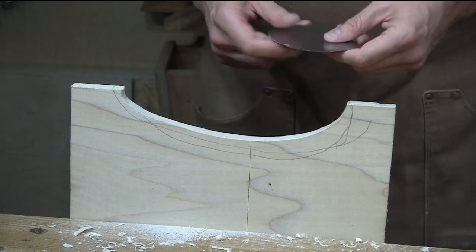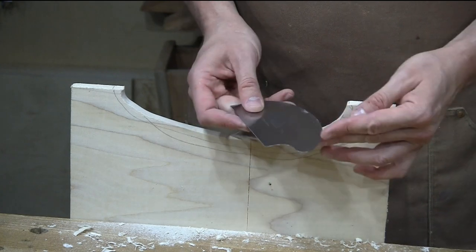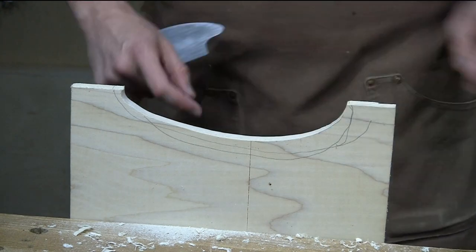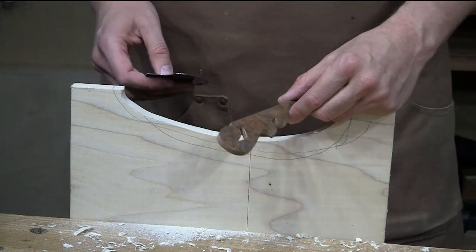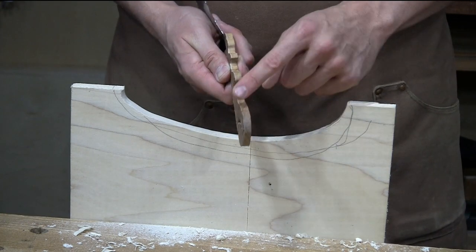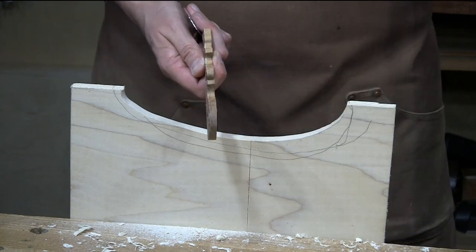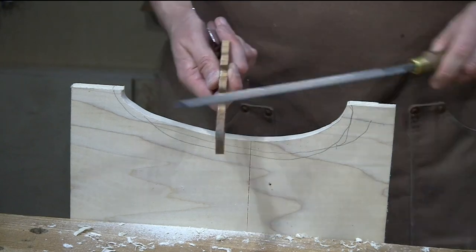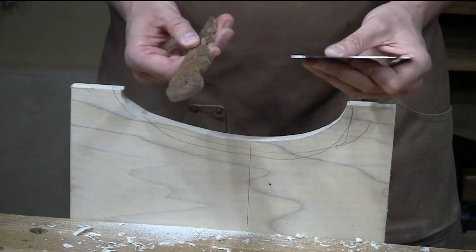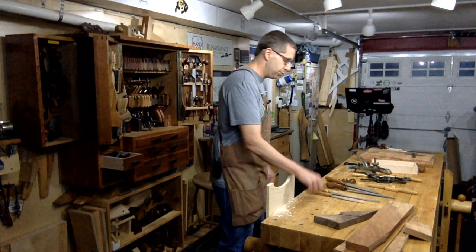You will find some instances where it can be very difficult to get a card scraper in. This chairmaker scraper from Bearcat has some cool curves and shapes to it — I've also got some gooseneck scrapers that get into nice curves and things. But if you're in a captive area, like a fretwork area like this, you can't get a scraper in there to do anything. You've got to rely upon files, riffler files, and things like that. This surface is very much a show surface — and it is finish-ready. I had to use my modeler's rasp and my files to get those surfaces.